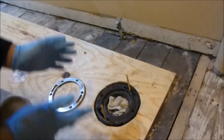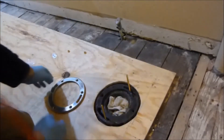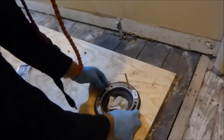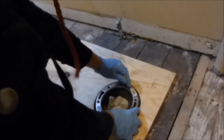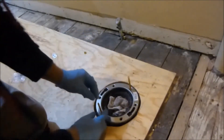I need the bolts to be lined up on this side so the toilet can go the right way — that's where this flange comes in handy. If it's not straight yet, you should be able to turn it a little bit, then just get the little nut and pop it on.